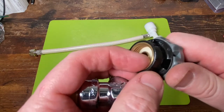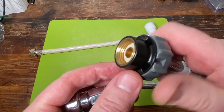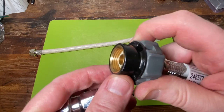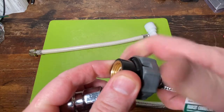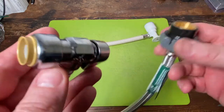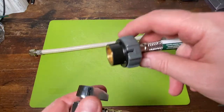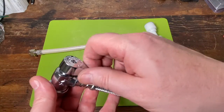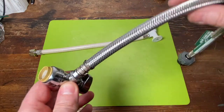You can see that this is a solid brass connector, and then they just put plastic - they said it's kind of like a gas cap style of connection. Once you get this on there and get it started, once you start hearing clicks like a gas cap, then you're stopping and you're good, and that's going to create a good seal. Interesting - I've never tried one of these out. I do like that this is a quarter turn style ball valve. This is good.